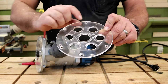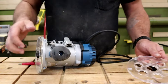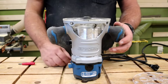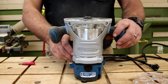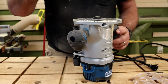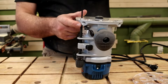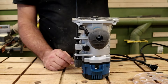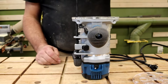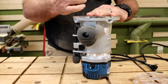To adjust the height when mounted under a table, just grab a little Allen wrench — they've got a threaded rod with an Allen wrench chuck, and there's a hole through the base plate. So you can have a corresponding hole in your tabletop and reach through to adjust the height up and down. It's not the same as a router lift table, but you're not paying $250 for a cheap one.